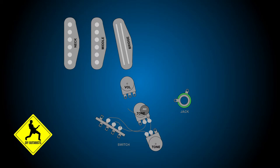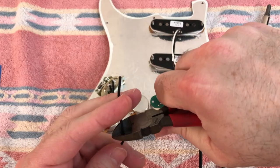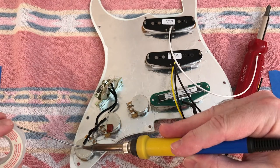It's time to ground the controls to control buzzing, static buildup, and any other problems that come up. Really all it takes is running a wire across all three controls. I'll start at the bottom and connect it to the middle control, but in order to only heat up the control one time, I want to gang all the connections together - that is the ground wire to the bottom control, plus the ground wire to the volume control, plus that last leg from the tone capacitor. I will run wire to the volume pot but I'm not going to solder it just yet. I'll measure enough wire to connect the tone controls, cut to length, push back the ends, place the wire, and solder the connection to the bottom control.